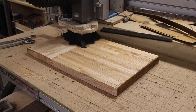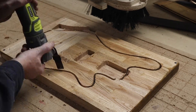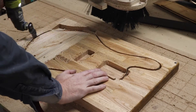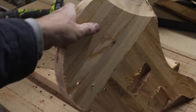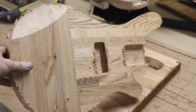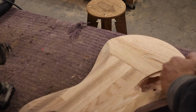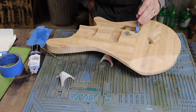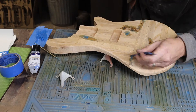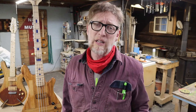Doing the same molding toolpath on the front, I get the front contour and then all my 2D cuts — everything looked good. The CNC can't do this for you, but I also have to drill a hole to run the wire from the pickup to the cavity, and later I'll have to drill a hole for a ground wire to the bridge. I used some tinted epoxy to fill in some of the mistakes in the wood. Okay, we're going to stop there with the CNC body, and now we're going to move on to making the body with the router templates.